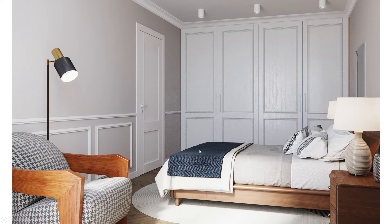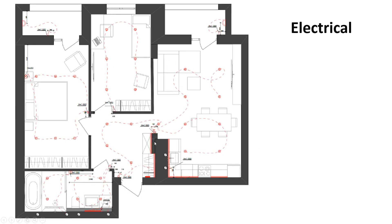Now these are the detailed plans — what goes behind the walls and under the floors to make everything work. This shows where all the lights will go from the ceiling point of view. We have LEDs in the closets, under the cabinets in the kitchen, and LED behind the mirrors. I was very specific — she asked if I want the exhaust fan on a separate switch, and I said yes. This was actually two bathrooms, so we have two drains and two exhaust ports. I want two exhaust fans in the bathroom so it stays dry and won't get mold.